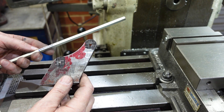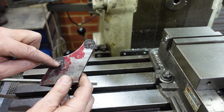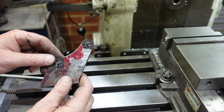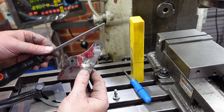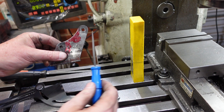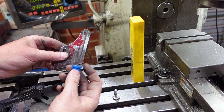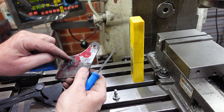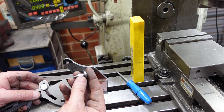I've got a piece of 6 millimeter key steel here and I'm going to use that as my check fixture. File the corners out, try the bit of key steel, and once that fits basically leave it alone. I filed out the holes with a file - I did find a full-size square file, although it's a fine one. However, the corners by necessity have a slight round on them, so what I usually do is get a needle file - I'm using a triangular one - and work that into the corners just to relieve them and make sure there's no material hanging up that would cause the square not to go in.